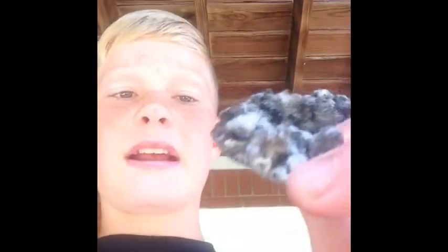And this here is that last piece of aluminum, and as you can see, it looks about the same on the bottom, but when I hit it, I knocked all this slag out. And that is not what I should have done. I should have just left it with a little pool and tried to remelt some of it down. And as you can see, this here is regular aluminum, but this is slag. You can tell by the color and just what's all in it. And you are going to have some slag on the ground in multiple areas.